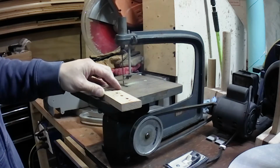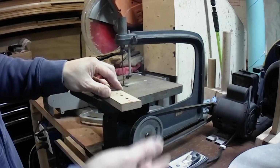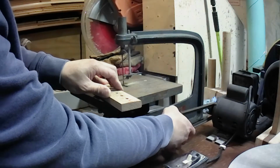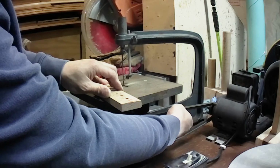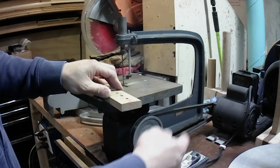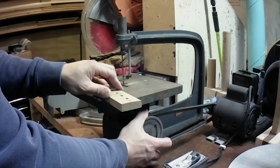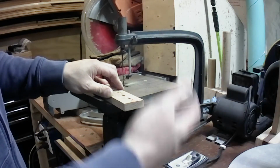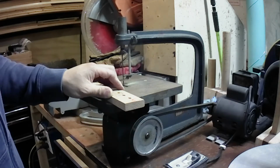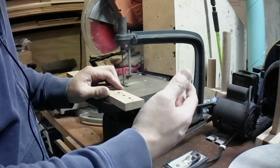You're going to see in a moment when I turn on start, the thing won't start. It's not because the machine is broken, but because the belt is old and has formed the shape, so the shape is preventing the belt from actually moving, so I have to help it along as it starts. Either that or the start capacitor is not really that effective. Either way, now let's hear the difference and look at the vibration.